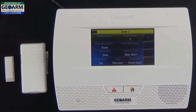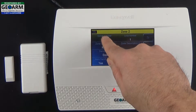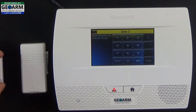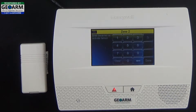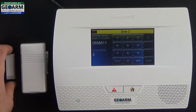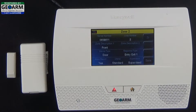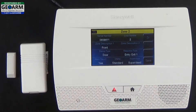Select Edit. Now you're going to see Serial Number, so go ahead and select Serial Number. You're going to separate the magnet from the contact three times in three intervals — once, twice, and once more. That will learn the serial number and the loop in there. Go ahead and verify those. Now the serial number and contact have been acknowledged by the system.